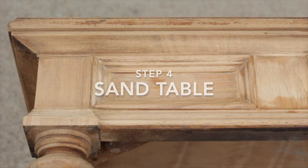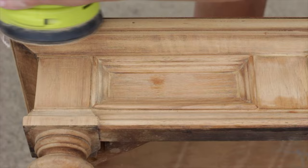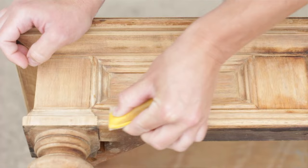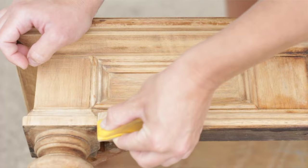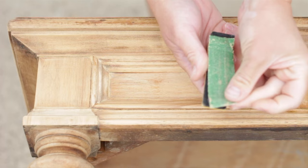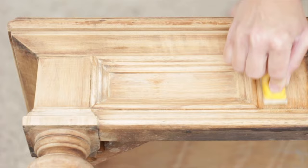Then I started sanding, which was a little difficult — but this is where my three favorite tools come in handy. I used the orbital sander on the bigger, flatter areas. We got the orbital sander about six months ago and it is a game-changer for stripping furniture. The other tool I love is a Gator sanding block — for all the intricate details and small areas, I could take the sandpaper off and put it on the side of the block to get a 90-degree angle and sand deep into corners.